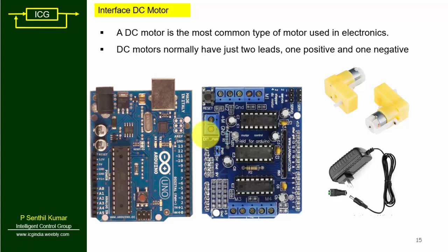The main advantage of this Adafruit motor shield is that we can directly fix this shield on top of the Arduino Uno board. Arduino Uno has female pins, and the motor shield has male pins — for example, pins 13, 12, 11, 10 are female on Arduino and male on the shield — so we can directly insert this board on top of Arduino Uno, which reduces a lot of circuit connections.